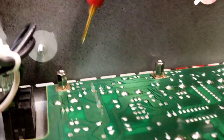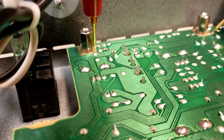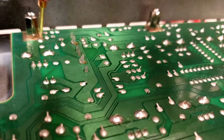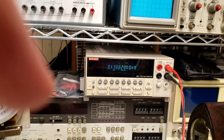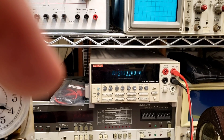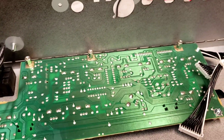I don't have enough hands here. Let me hold the camera and measure this terminal with my left hand — measuring from circuit board to circuit board. It is less than a quarter of an ohm from this pad to this pad, but from this stud to this stud it's bouncing all over the place — 200 ohms, 150 ohms. Anything more than half an ohm for your ground is — I mean, you've got to be kidding me, Roland.